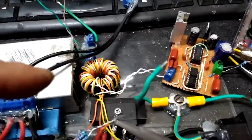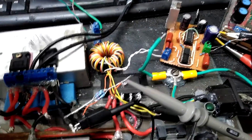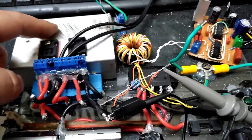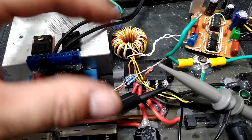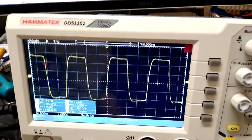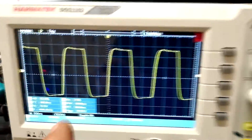Now I've got this other half bridge on here. This is one I was running — it seemed like it ran fine, seemed like it ran from a pretty low power output, nothing amazing. But I never really had any indication that these FETs were just completely in the linear region pulling way too much current and the switching was just not suitable at all. The thing is, I had no gate resistors on this circuit. Here's the waveform — I've got the voltage down really low because the interference is absolutely driving my phone nuts.